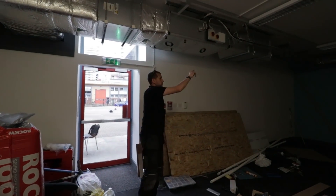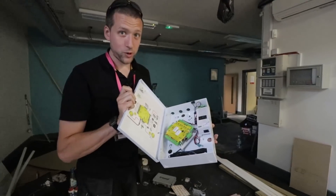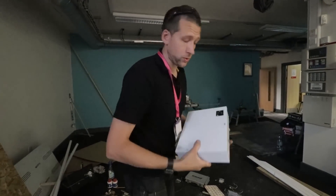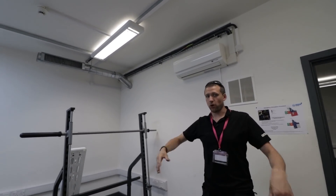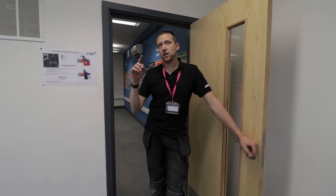Out here there are five fittings to replace — LED fittings — two of which are emergency packs. These are the Paxton power supplies for the access control. It's really interesting kit once you start to learn how to use it — properly cool stuff. I'm actually going on a training course shortly to learn how to do it. I'd say there's a good week's work here to do all of that, because these light fittings — you've got to put a bush and coupler and drill into the trunking, so it's not just a quick bish-bash-bosh. You've got to drill a 20mm hole twice, bush, coupler, lock ring to get them to sit on the trunking. I allowed about a week — probably five days' work to do the Paxton, change all the fittings, and shoehorn the extras in.